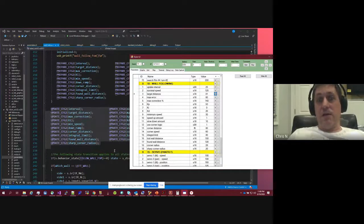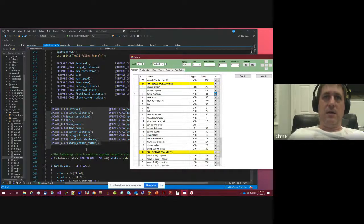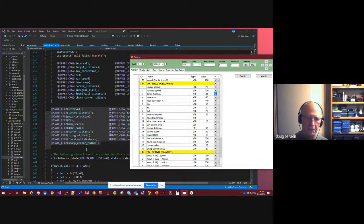Yeah, I did, however, on the Bluetooth link in the other direction from robot to PC, since you brought up efficiency, I was constantly streaming all the values, meaning sensor values, all the time at a fixed rate. Even though it may seem inefficient, even if nothing's changing, I find that to be quite useful. So I can actually have a complete recording of what the robot was seeing right after I run it around.